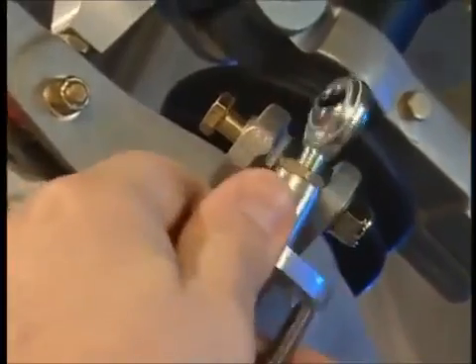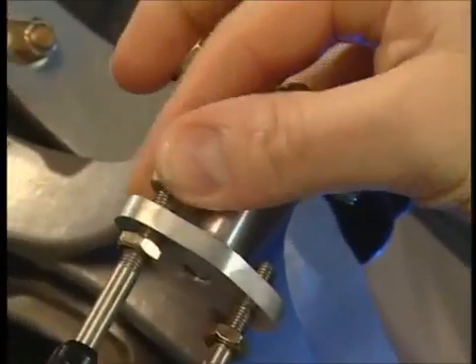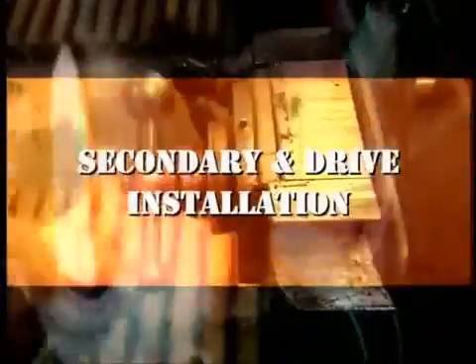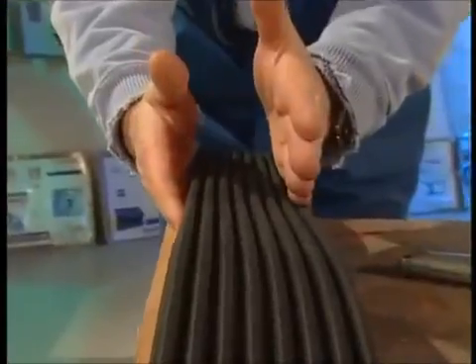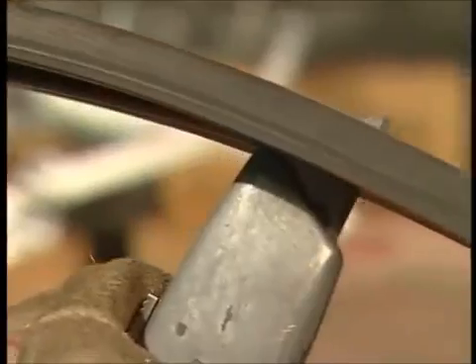That will then move this, which is a rod end on a control T, which fits on the top like so. Just drop that down, put the lock nuts on, and it will move it into the perfect position to fit in the clevis — and then the job, as they say, is a good'un. Now, you may be wondering why you as the builder have to cut your own drive belts from one big belt. The reason is you need to guarantee that all the belts are exactly the same length, which of course they will be if you cut them from one master belt. I need two ridges and a groove in between for each belt, then with the knife up from the other side it's a steady process of cutting away from you down that groove. I'll sand the rough edges off after each belt is cut.